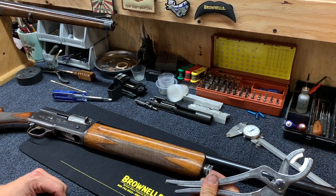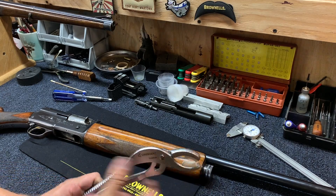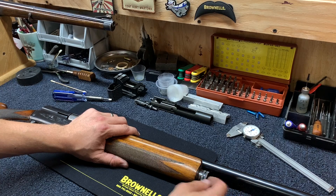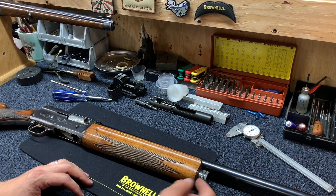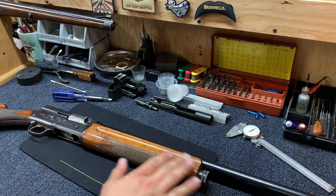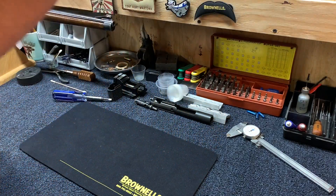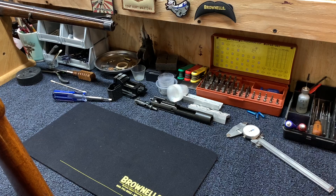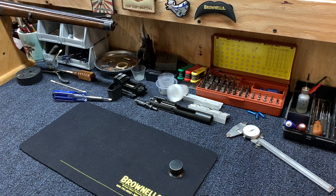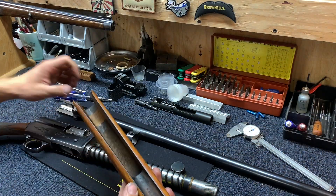The tool I'm using here is mag tube padded pliers, these are from Brownells. They have pins in the jaws so you can replace them when they're worn out — this is a brand new set so it works out pretty well. What I like to do is just crack this loose once. This mag tube cap has little detents in it and there's a spring and plunger inside the forearm, so you'll actually feel it clicking. You don't want to unscrew it fully right now because you're under spring pressure of that full recoil spring, which is a very stout spring. You're going to stand it up on edge and basically pull down on the barrel while unscrewing this. As you're pulling it out, this is what it's going to kind of look like — you can pull the forearm off first too if you'd like.